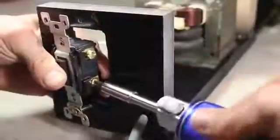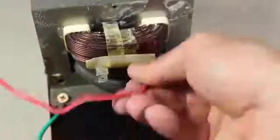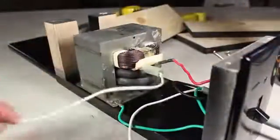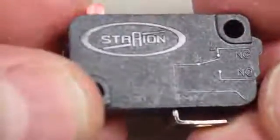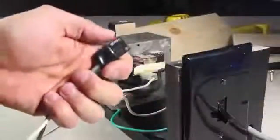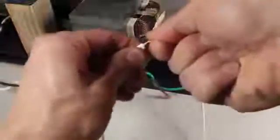I've exposed the copper on the black wire, and that will get connected to the bottom terminal of the power switch and screwed down tight. This salvaged spade connector still fits onto one of the transformer's primary terminals, so the other end of the wire can be connected to the top terminal of the power switch. Now the switch can be screwed down permanently, and a cover plate added to protect from electric shock. The other spade connector goes on the left terminal of the primary coil. I want to add one more switch for convenience — this switch still has the original wires and connectors from the microwave, and I've added a wrap of electrical tape. I'll strip the end of the white wire and twist it together with the other white wire coming off the primary, then use a wire nut to cover the connection. Now the black wire is joined with the white wire coming from the power cable, and the electrical system is complete.